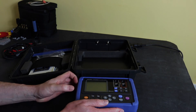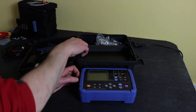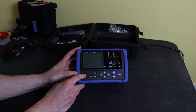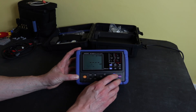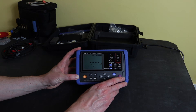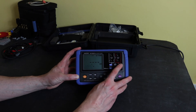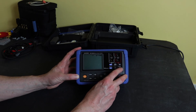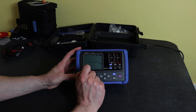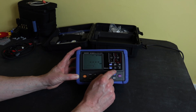This instrument is designed more to be utilized out of the case, and you do get a strap to hang it around your neck if needed. There's also a USB comms lead included. With regard to resistance and voltage measurement, this instrument has four resistance ranges: 3 milliohms, 30 milliohms, 300 milliohms, and 3 ohms — the 3 milliohm range being an addition over the old instrument. The voltage ranges are 6 volts and 60 volts, so they've doubled the voltage range against the old one.